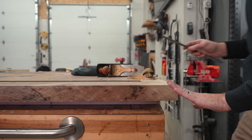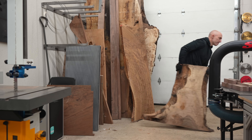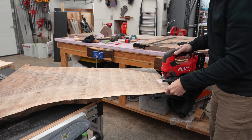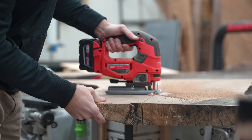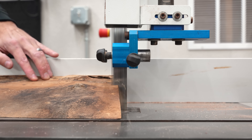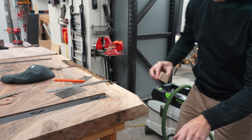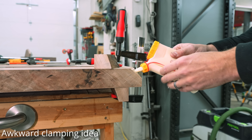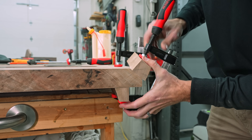What I'm doing is getting a nice flat spot on the corner. Over here I have an offcut — that lighter wood is the sapwood on the edge of the slab. I'm cutting off a chunk of this, trying to match the grain and color as closely as I can. I spent a lot more time than I'm showing here — cutting multiple pieces, cutting at different angles, jointing different sections, finding the perfect color and grain orientation. I never actually told the client I did this, so my goal is he doesn't realize until after he watches this video.